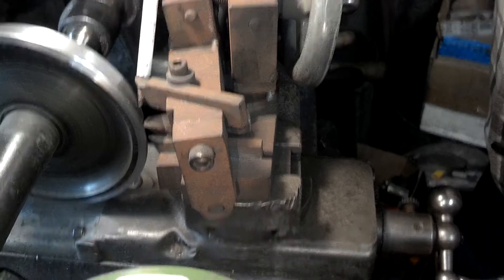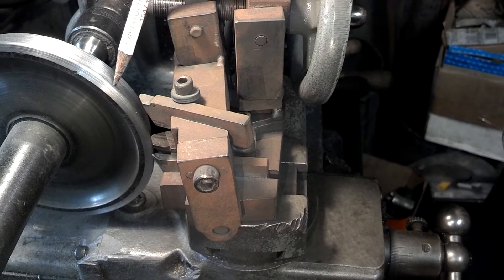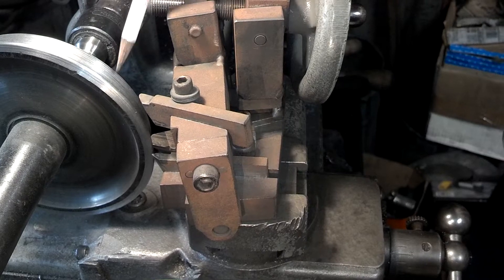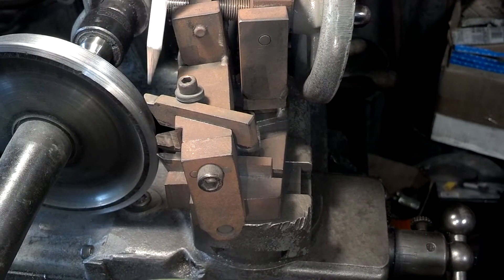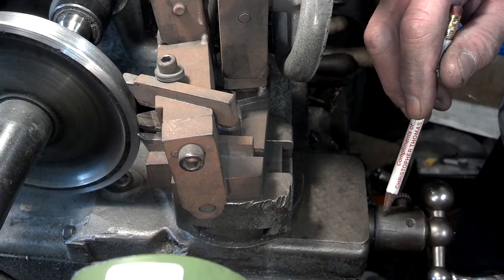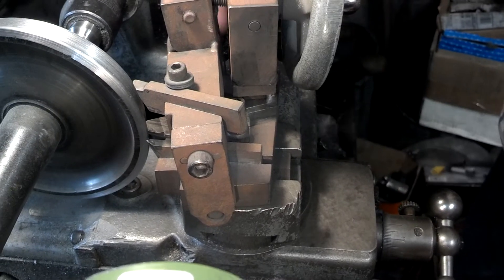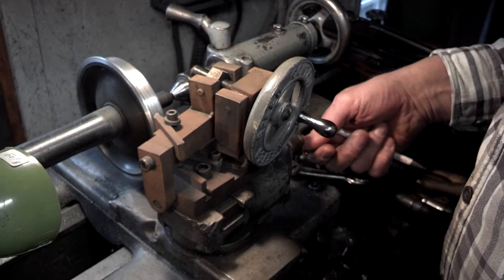You continue until your desired diameter — so this tread would be zero degrees and you can measure it easily, the tread diameter. Once you're happy with that, you reset this back to zero.